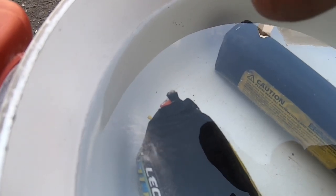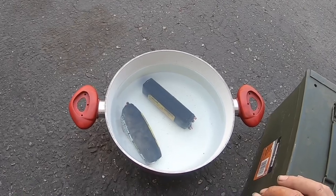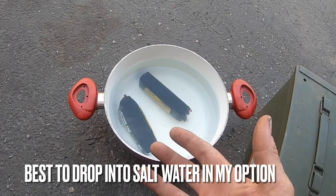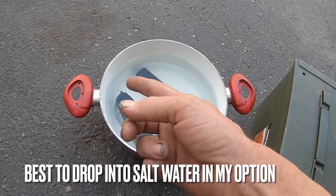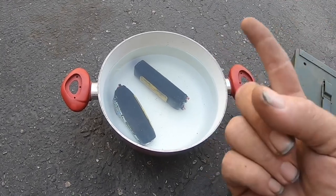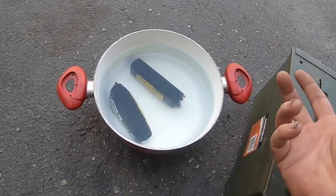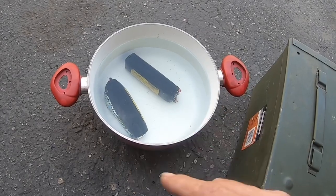The nice thing about doing it this way is that some people say connect to the battery terminals and you can discharge that way. But if you have a battery that was fully charged and a cell desoldered itself inside, you would only suck the voltage out of the two cells that are still connected. The single cell that's about to blow up is still fully charged, because it desoldered itself, so the jumper wires are no longer there. That's why this is a good, clean, safe method.